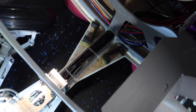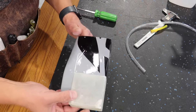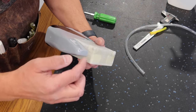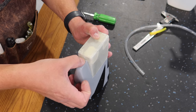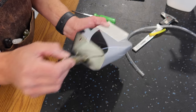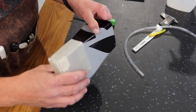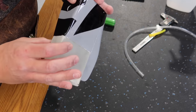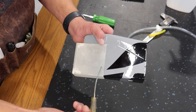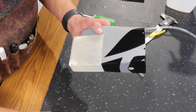So now we're going to mix up some Hysol and we'll get these guys glued into place. We've got our mounts glued in place and we're just letting those cure. While waiting for the mounts to cure, I was working on the box here. I did some final shaping with sandpaper to get this fitting perfectly and spot glued it in place — held it, put a little bit of medium CA on the end point, used some kicker to get it stuck, and from the inside did a little bit on the joint on both sides. So this box is in place now. What we can do now is run some masking tape all along the perimeter and then use some pieces of fiberglass to get that joined together — we're going to be putting some fiberglass to span this gap right there.